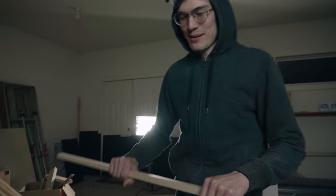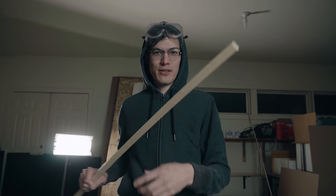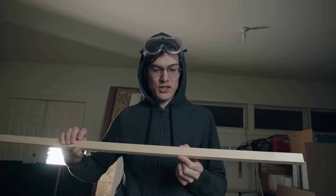Yeah, so we've got the boards ripped down to 1 inch thicknesses. So we now have a 3/4 inch thick by true 1-inch. We've ripped them all down, and now we will cross cut them with our cross cut sled that fits into the table saw and just bzz, bzz, bzz, bzz. There we go, let's do it.